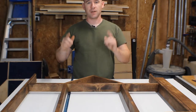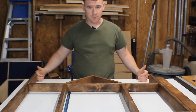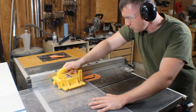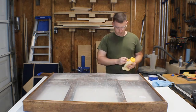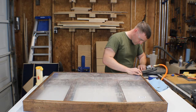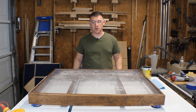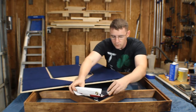I've got a big sheet of plexiglass over on my rack that I got from my local home center, and I'm going to cut that down to fit the box and attach the back piece to it. I'm putting a finish on the frame using shellac — one of my personal favorites, super easy to use. I ended up applying four coats of finish, sanding down to 320 grit in between coats. Then I place my flag in the display and reattach the back.